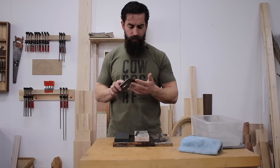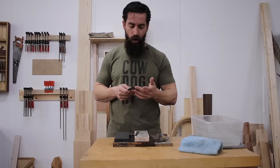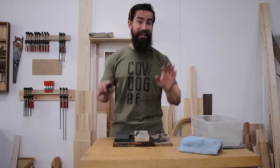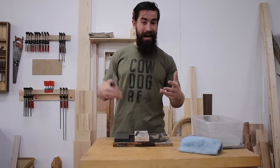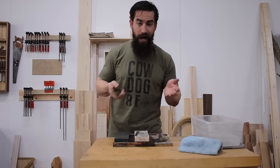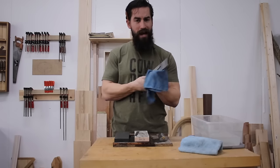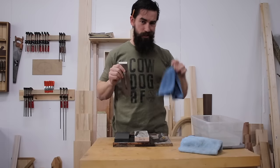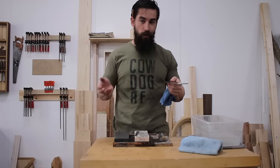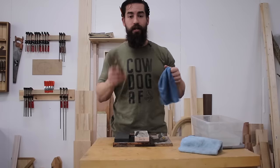The last thing I'm going to do is check it for sharpness. I'm not recommending you do this, but what I often do is run my finger very lightly over the tip to feel for any imperfections. You can very easily slice your finger. Some people like to shave arm hair or finger hair, which is fine — this is cutting cleanly. But I don't care if this cuts hair; I care whether it cuts wood. Now that it's good and sharp, I'll wipe it down with a rag that has some oil on it to prevent rust. This rag is soaked in jojoba oil, which is fancy, but three-in-one oil or light machine oil from Harbor Freight will do just fine.